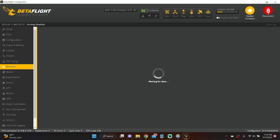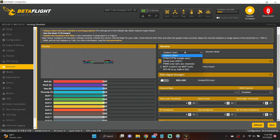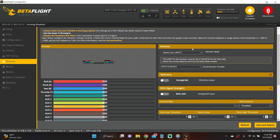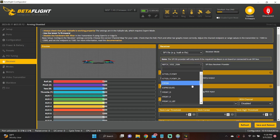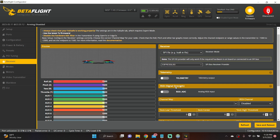Also, you could have the TX and RX inverted on the UART. Double check that the receiver's TX goes to the flight controller's RX, and the receiver's RX goes to the flight controller's TX. And in the receiver tab of Betaflight, if you're using a UART-based receiver, make sure you've selected 'Serial UART' and chosen 'CRSF'. If you're using an SPI-based receiver, select 'SPI' and make sure it says 'ExpressLRS'. Save that and reboot.